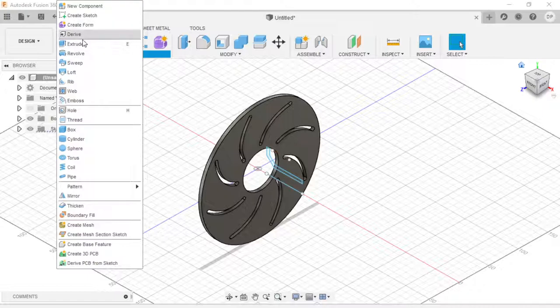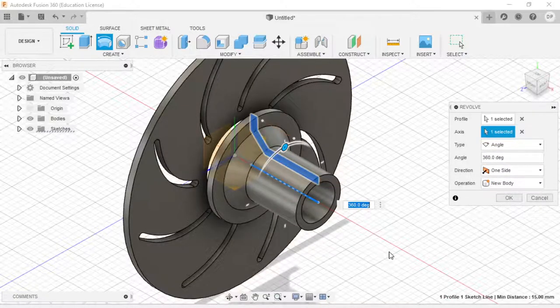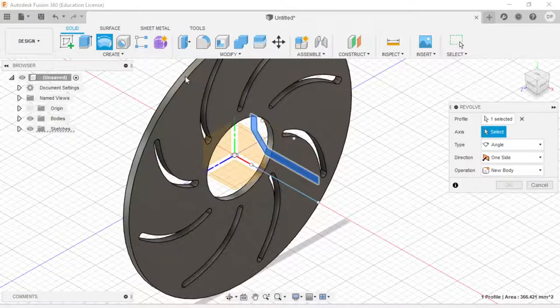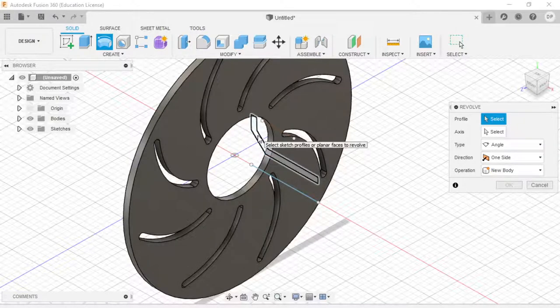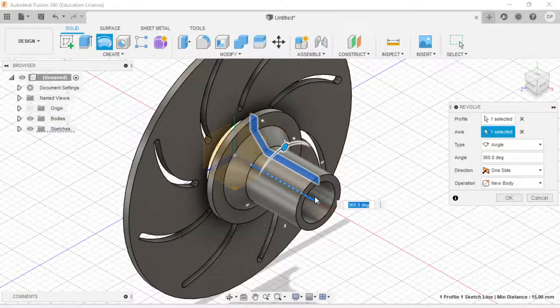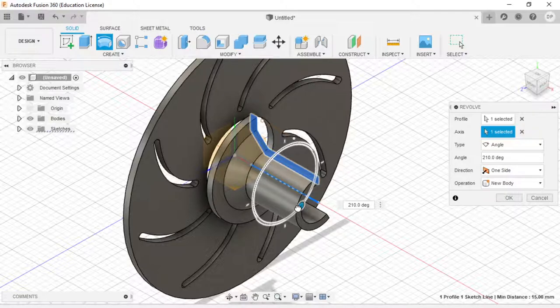We're going to use the revolve tool, so we're going to be creating, revolving, press that shape, select that surface that we have. The axis we want is here, and we're going to get a path that looks like that. Can you do that again, sir? The revolve, okay. So we're going to go here, we're going to press revolve. Under our profile is this shape over here. And the axis, so we're revolving it around this line that we made here. Which gives us this shape over here. Your revolve, by default, is going to do 360, but in theory, you can do a semi-revolve if your shape needs that.